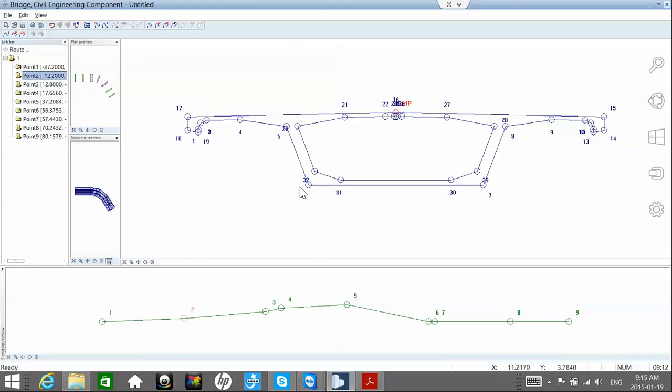Normally, if you have a 3D polyline, you can generate two profiles. One would be the profile in plane that we are seeing now, and the other would be the profile in elevation. And the program can associate the two profiles and give you that shape. The alternative we've been working on was to just draw in plane the shape and then change it here manually the height of every point. But the only problem in this method is that this example is too simple as opposed to your bridge, where you cannot identify exactly where the point in plane is.